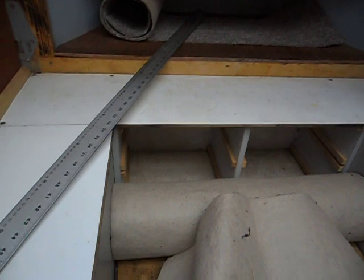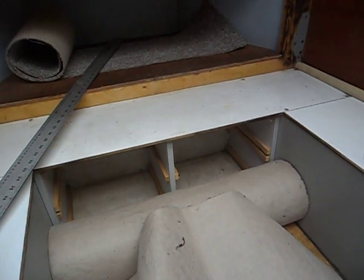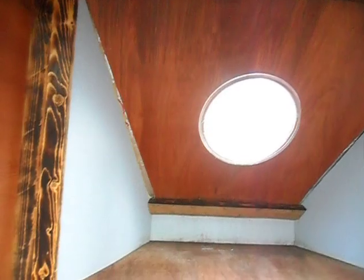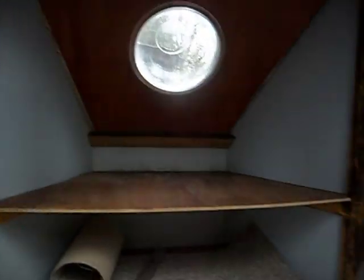There was a set of drawers in there but they were really too stiff — too tight to be practical — so I've taken the drawers out and I shall use that space in another way. I haven't made any doors in the front of it yet but I probably will. I've lined it — you can see this is quite a nice interior — plywood, redwood-faced plywood that I've used for the side panels. The front panel sides still need trimming; I cut that rather badly, but I couldn't bear to do it again because of the potential waste of plywood, so I'm going to cheat and put some strips of wood over those sides to hide the gaps.